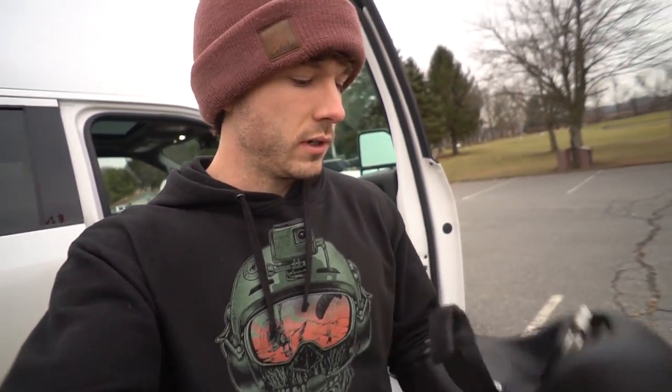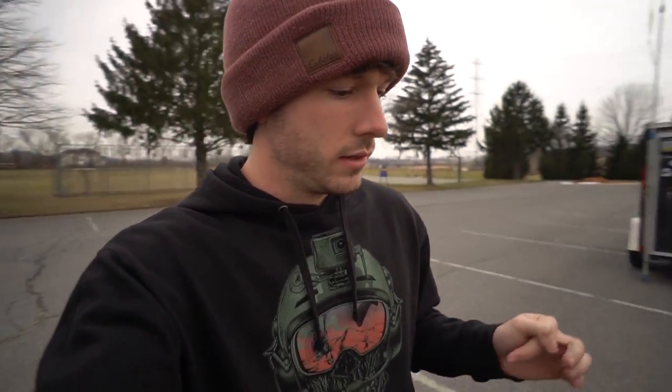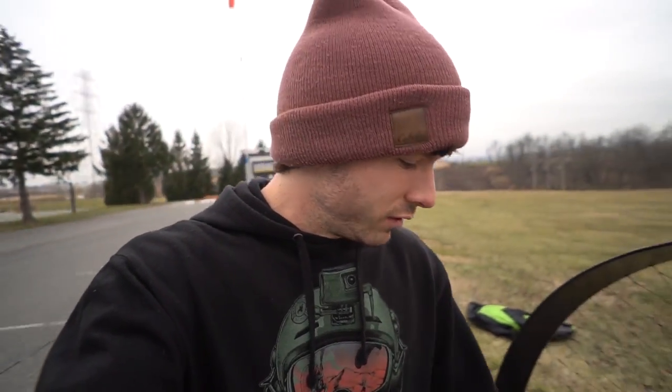All right, so this is why you always want a pre-flight. I don't know how long this has been going on, but I just noticed it — big old crack in my airbox. One of the things I do on a pre-flight is just grab random parts, grab the exhaust, grab the parts that can fall off or go into your prop, and just yank on them — and this guy was a little sketchy. So I'm going to do something irresponsible that I don't recommend anyone else do: I'm just going to fly without it. Because I either don't fly, which would be lame, or I fly with it on and if it departs it can go into my prop — even though it has a lanyard that Vittorazi designed, it could still hit my prop. So I'll run without an airbox and risk it getting a little lean. If my motor blows up today it will be completely my fault. I have another airbox back at home I can throw on, so we'll be good.